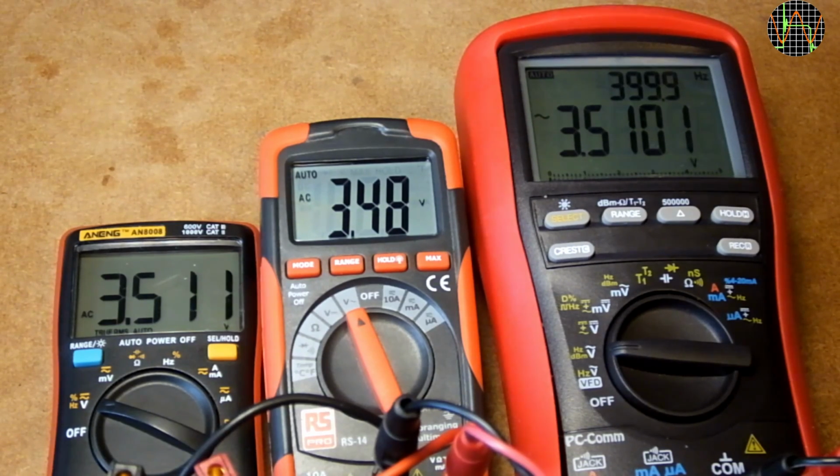At 400 Hz we have a loss of 1 digit and the error has increased to 0.85%. At 700 Hz we have lost another digit and are in the 1.1% error range, but nothing further happens all the way to 1 kHz. At 2 kHz we are at 1.5% error.